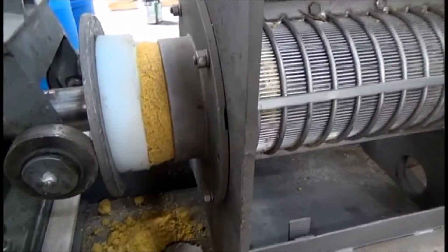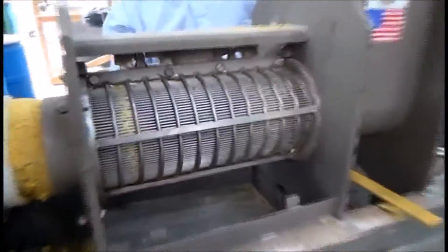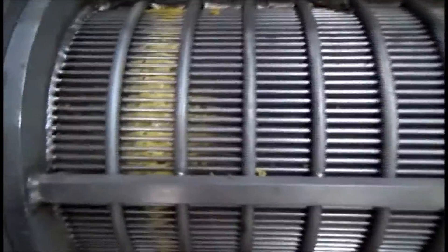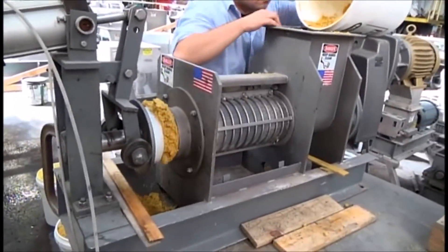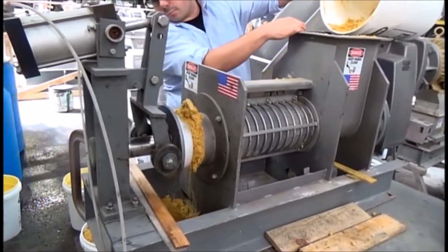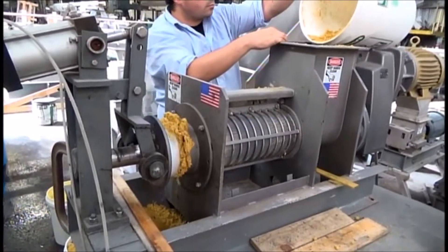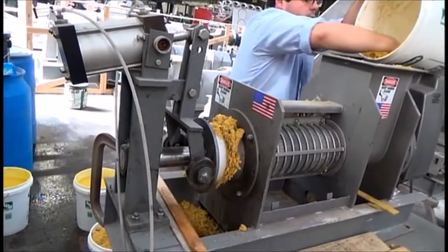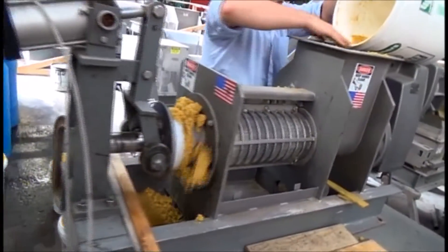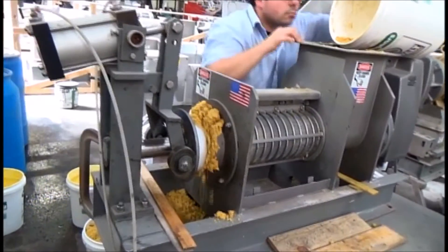The cake is starting to come out, but we're not getting any water out. We're forcing a bit of moisture through the screen, but no liquid in the pan. With that, I'm going to run the air pressure up and see the cone closing up as I increase the air pressure on the disc load. I'm up to 60 PSI — I better back off a little bit. I'll go to 3 bar, 45 PSI.